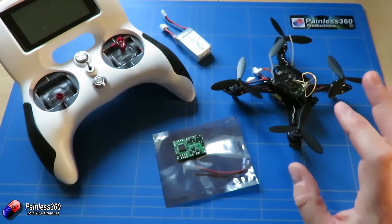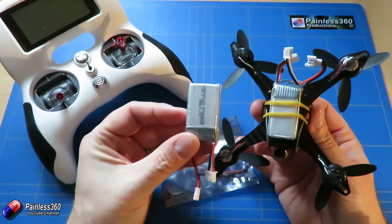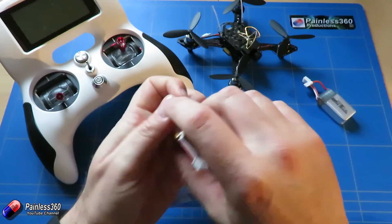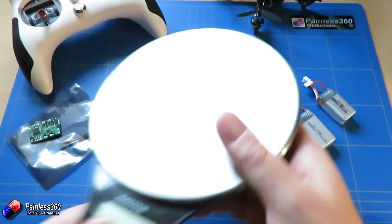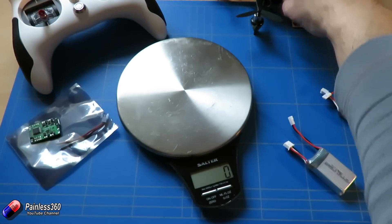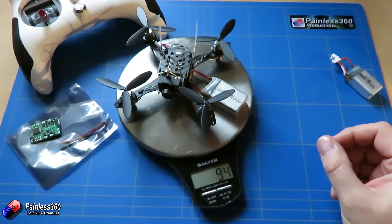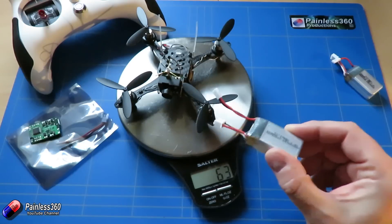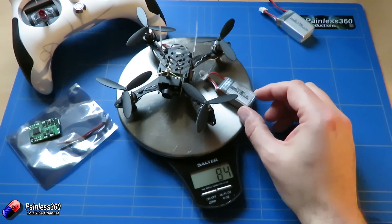There's a link in the description if you want to buy the same kit, because a couple of things were changed from the very early days of its inception. The first thing you'll probably notice is the battery size has changed — it's now a little 380mAh pack as opposed to the 500mAh pack. The smaller pack is 20 grams and the bigger pack is 31 grams, so that 10 gram difference makes all the difference. The overall weight of the model is about 84g with the lighter battery and about 95g with the heavier one. With the heavier battery the flight performance is very sluggish and slightly underpowered, but at 84 grams it's flying fine.